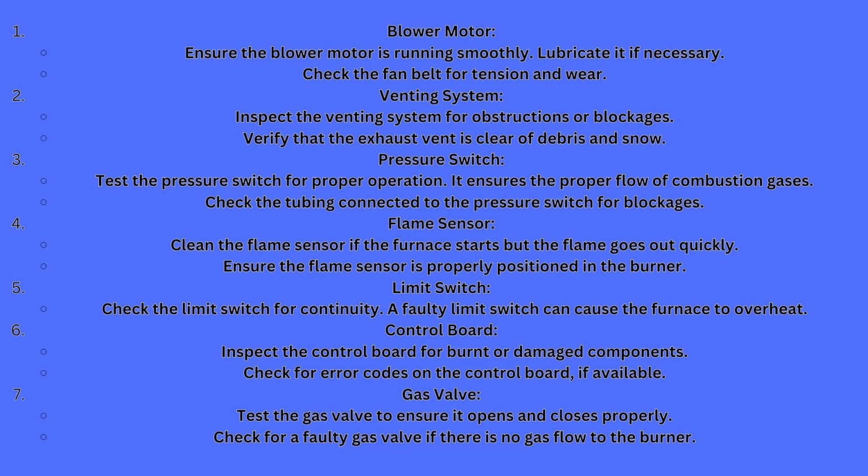On the side panel of your door, no matter what unit it is, if it has control areas, it'll have a list of those, because that control board will give a sequence of events. Let's say it's number 2. It'll flash twice, it'll pause, it'll flash twice again, letting you know that it's number 2. It might be number 7, number 8, number 13. It might flash once, pause, and then flash 3 times for 13.